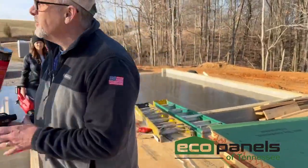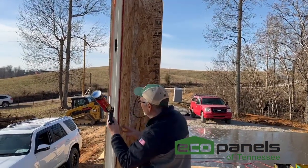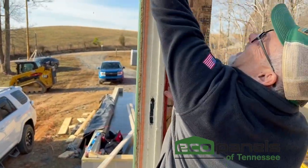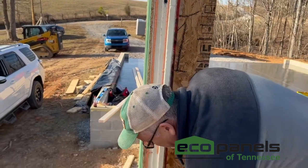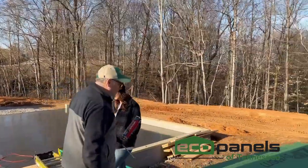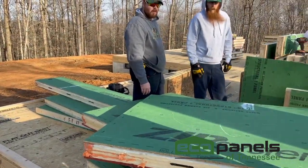Then we want to apply foam to the tongue-groove where these panels are going to go. I like to put a good bead on this side, and then a nice bead on this side. And you're going to say, 'Rob, you missed that top part' — because I'm not quite tall enough. So I come around to this top edge of the panel and put a little here to make up for the part I couldn't reach from the top.